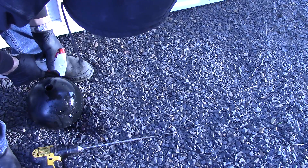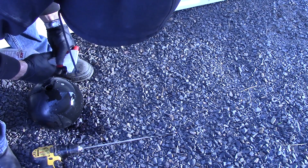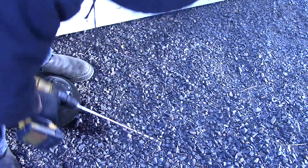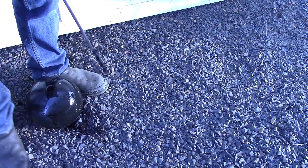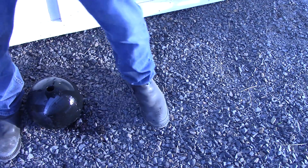You can see it's started getting warm from the friction. If you want, and it's kind of warm in there, you can add a little water for lubrication — that helps clean it out also when you're drilling. It goes through pretty fast but you can see that drill bit getting hot. Now we're ready for the next step.